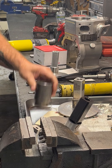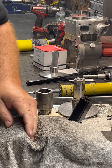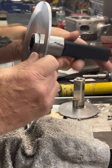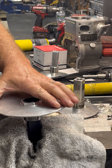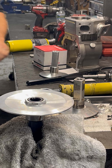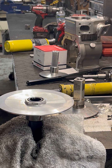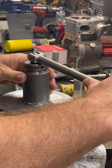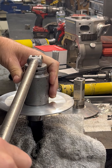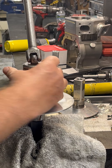That lead would cause this to pop up and off and kind of screw your whole thing up. So to do it with a socket and a vise, put a towel in there — or plastic jaws, or something that won't mar your posts — put your post in, clamp down on it, grab yourself your breaker bar, and put that in there. Now the big question is, is this righty-tighty lefty-loosey? No — this is left-handed thread. So turning it right will loosen it. Take note of that. Put it on your sheave and turn it right, and loose it comes.